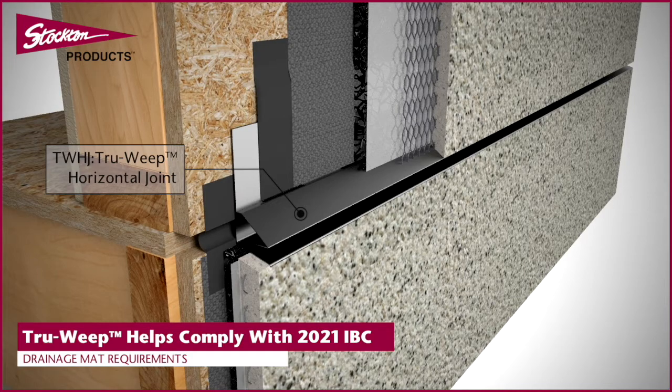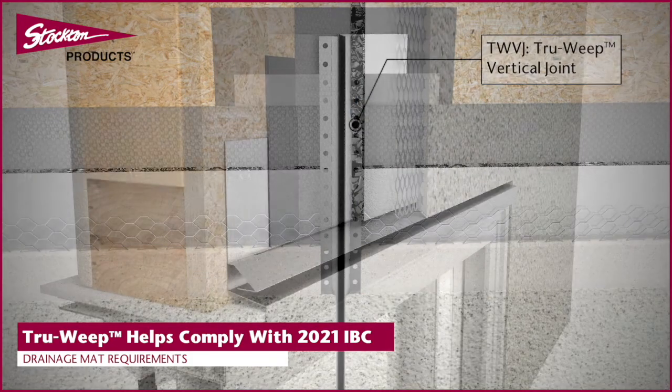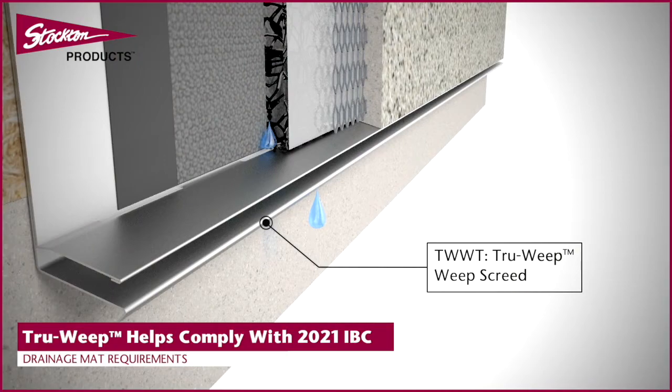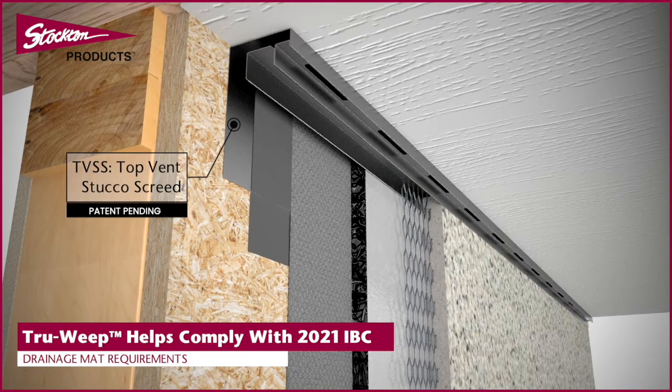The 2021 IBC now requires additional drainage mat between the water-resistive barrier and the cement plaster over wood-based sheathing. This new requirement covers types 3, 4, and 5, which is a significant portion of the multifamily construction market.